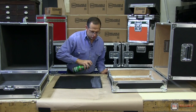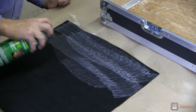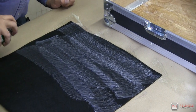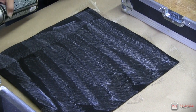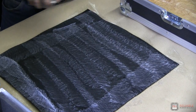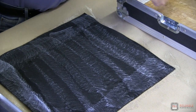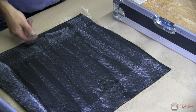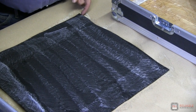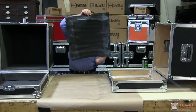We're going to do the same on our carpeting — just nice even strokes. It lays out in what's called a web pattern or a lace pattern. Make sure you hit the edges well. It doesn't have to be real heavy, just a nice even coat. Things are tacking up well here — we'll give this a couple of seconds, and it's all set to go.